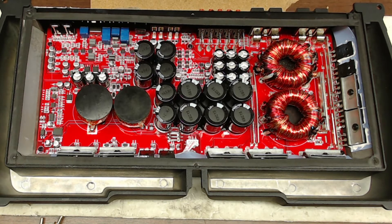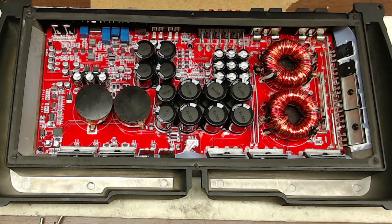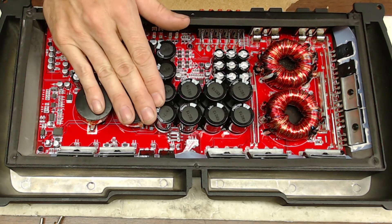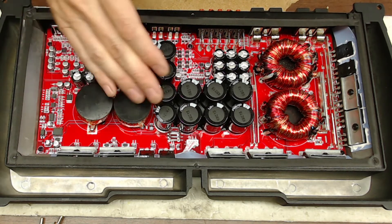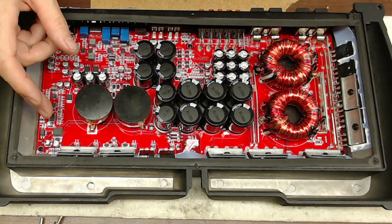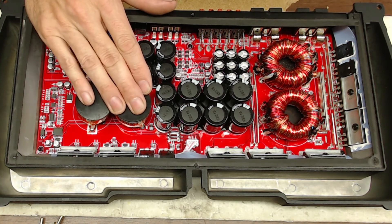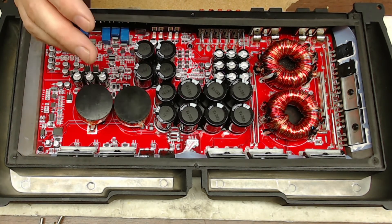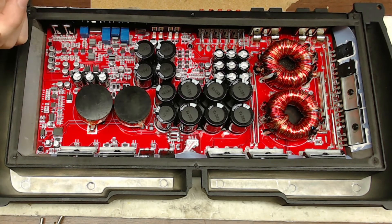That's 94-amp 200-volt transistors versus the 200-volt 50-amp transistors currently installed. The specifications are fairly close — the 90N20s have a little higher capacitance than the 260Ns — but we're going to pop them into that circuit and see how it plays with the IRS2113 IC. We may have to change some gate resistance values slightly, but I think I'm going to make this more of an experiment than just a repair and resell.